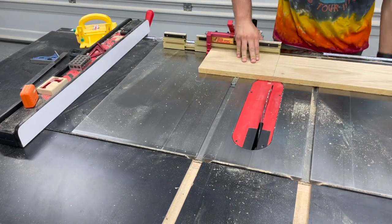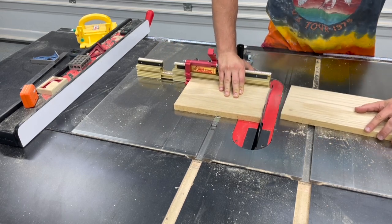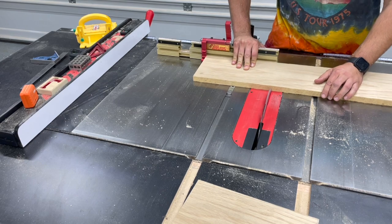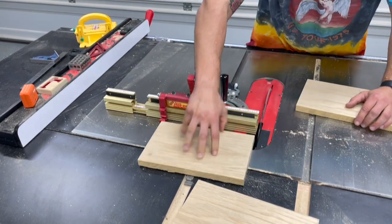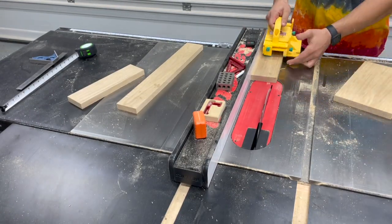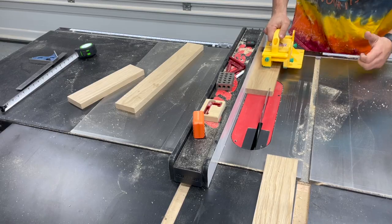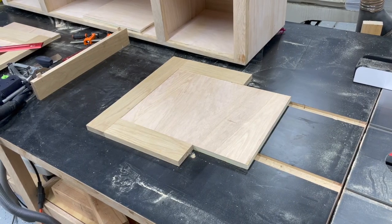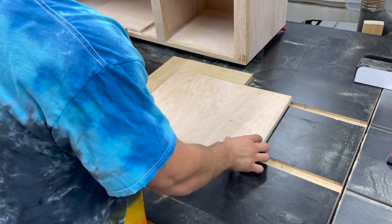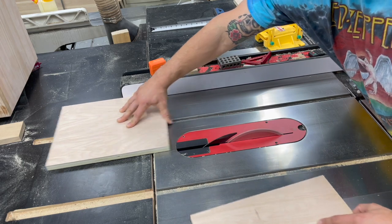With the legs set off to the side to dry, it's time to start working on these doors. I'm cutting out the pieces for all my rails and stiles using solid white oak, and I'll have a plywood inset in the middle to give the door a nice solid feel without having to deal with all the panel glue-ups involved with doing solid doors. Once everything was cross-cut to final length, I ripped everything down to its final width at the table saw — I like to do this all at once so everything is a uniform width. To size the panel, I just set it inside the door frame and made some marks — I find this a lot more accurate and faster than trying to take measurements.